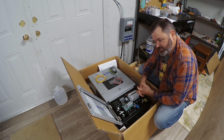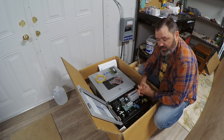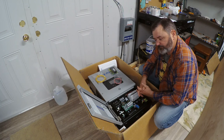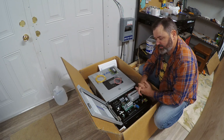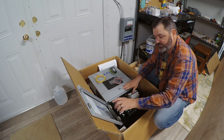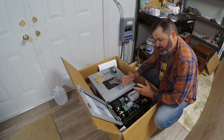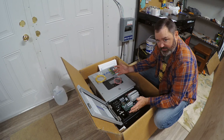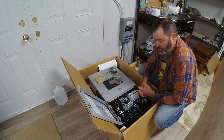All the way down to the continuous AC pass-through — which is something I mentioned when I did my swap of the outdoor 12K for the indoor 12K. Reading the data tags on both boxes, our original 12K was a 12,000 watt continuous AC pass-through, and the outdoor unit was 15,120. The indoor unit was a 50 amp pass-through max, and the outdoor was 63 amps. Well, that's exactly what this unit is — its max continuous AC pass-through is 15,120 watts at 63 amps. So aside from the MPPT input limit and the charger inverter limit, it's pretty much the same hardware, which even though the case is kind of big for a smaller unit, is nice because it's a sturdy, robust unit.